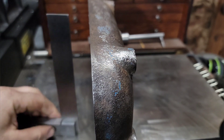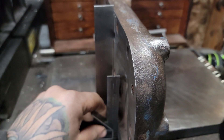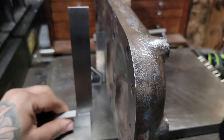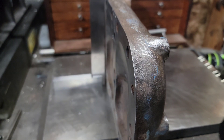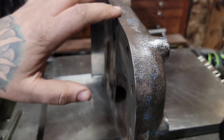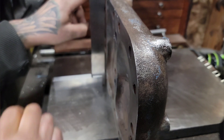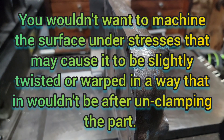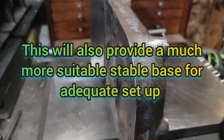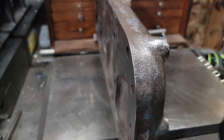The upset on the other side has a tendency to make the back side at the base higher. If I put a square on there, you can see that sucker is off quite a bit. The reason you want to address those first is when you set this up on your mill, you want this thing to be in its resting position about where it needs to end up. When you strap it down, you're going to introduce all kinds of tension and variables that can cause chatter or make the thing shake loose.